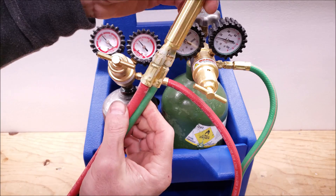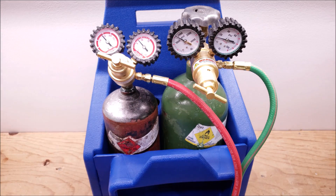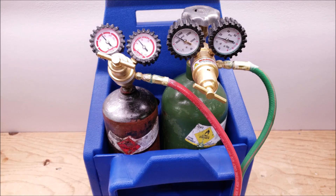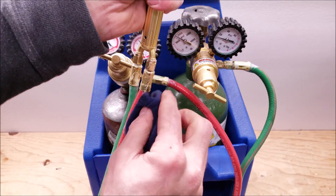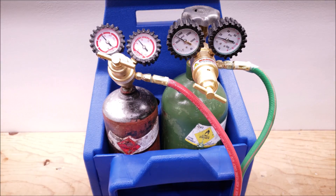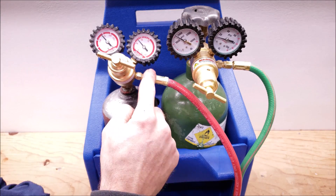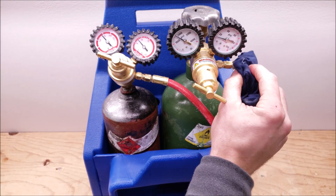Right now you want to leak check — give it about a minute or two and check to see if you see any bubbles. I'm going to hit these again with bubble leak detector and then we'll be safe. After two minutes with no bubbles, go ahead and wipe these down. Make sure you're not using dish detergent and water — use non-corrosive bubble leak detector. The chemicals in dish detergent nowadays are a lot more corrosive than they used to be, and you don't want that eating away at your hose or brass. It's safest to use bubble leak detector, the same stuff you'd use on your refrigerant lines.